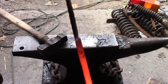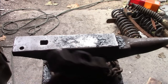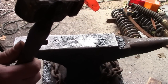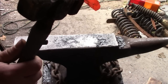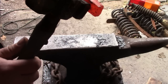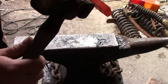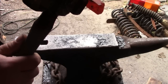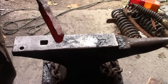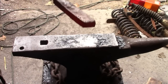Okay, so here's a real good example of something you want to deal with now when you notice it. I've got a weld that didn't take right there. It's only on the last few layers, but if I go grind it out now, it goes down about an eighth of an inch, and it goes in about a 16th of an inch. So if I just ground that little section out right now, yeah, it might mess with the pattern a little bit, but it's going to deal with that flaw now, and I don't have to worry about it later.